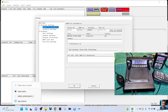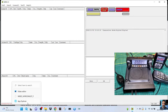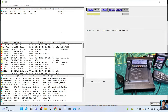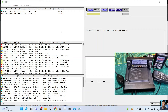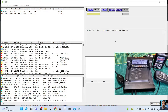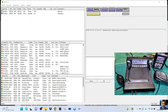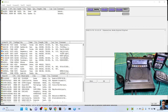Give it a couple of minutes to set up — there are some settings you can play with, but at the moment I'd say do nothing to get used to the system. Once it boots up, if the radio displays a frequency it means you're in access mode, where you can use a C4FM walkie-talkie with the FTM-100 as a hotspot. Push the A/B button and it will say direct mode, so you can use the microphone and radio as normal. Now we need to connect to a room. The middle section of the software shows user IDs, the bottom section shows room IDs.